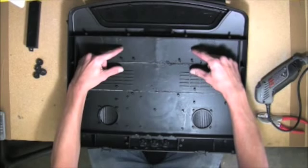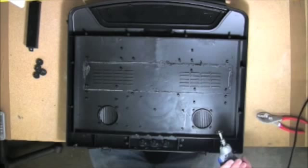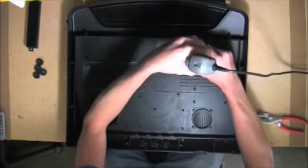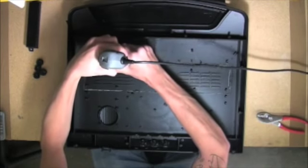Note these four standoffs. Do not remove them. Using a Dremel tool, wire cutters, or pliers, remove all other small standoffs as they can prevent the wiring from being routed properly through the canopy.